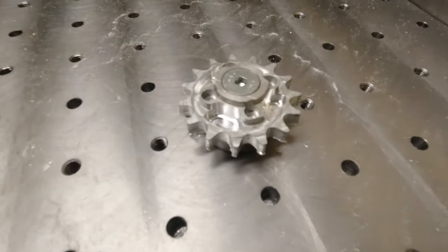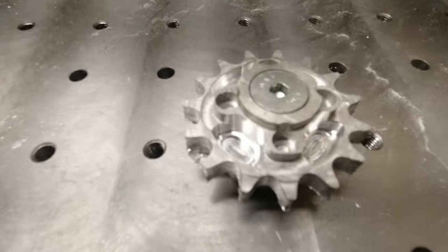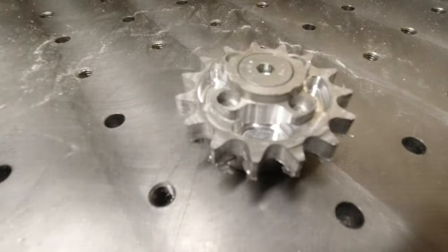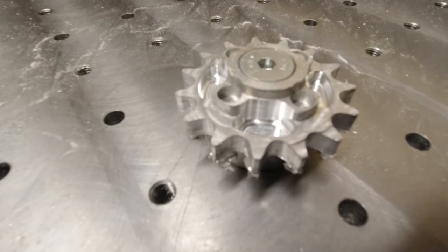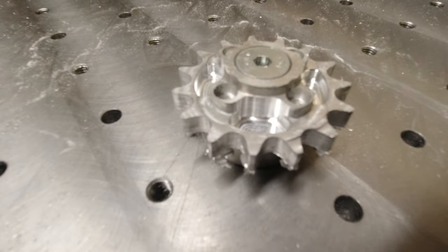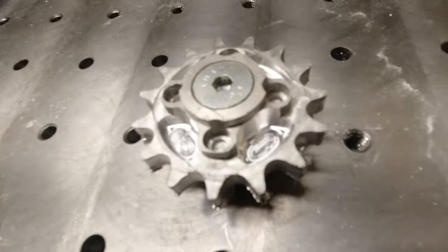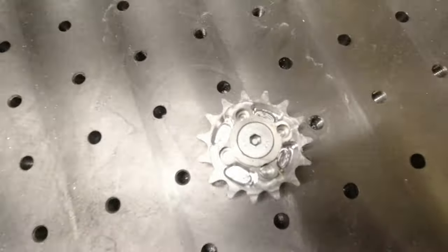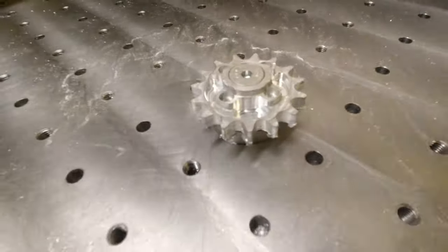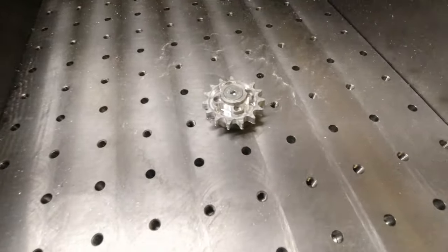There we go — now it's finished. I made the last finishing passes with my new end mill: hard metal 4mm with 1mm radius bull nose, with a special coating for aluminum, and it worked so good. The surface is super perfect with no sticking whatsoever — I didn't use any coolant or fluid, nothing. It cut so well. Now I'm going to take it loose and clean it up a little in the lathe, then we'll see the finished part in a little while.